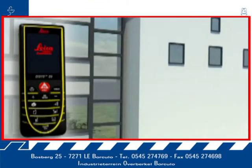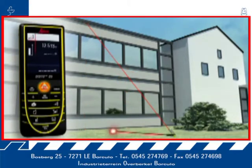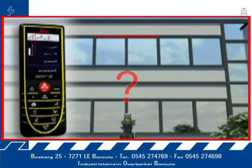You have to determine the height or width of an object, but you cannot point directly at it. The Leica Disto D5 can also solve this situation. Thanks to its three Pythagoras functions, the horizontal or vertical distance can be determined indirectly by taking two other measurements. It's important when doing this that the second measurement is at a right angle to the target object. With a minimum of measurements, it's child's play. If this is not possible, you can use a double Pythagoras function where the Leica Disto D5 calculates the result for itself from three measurements.